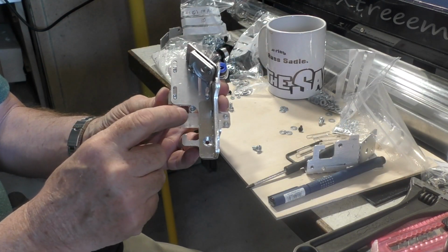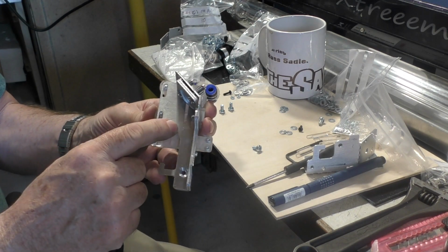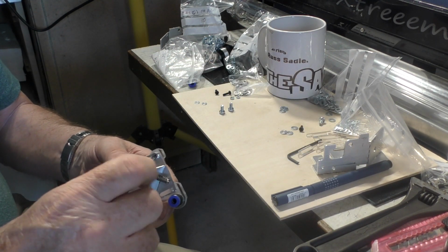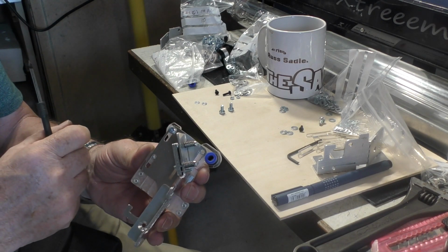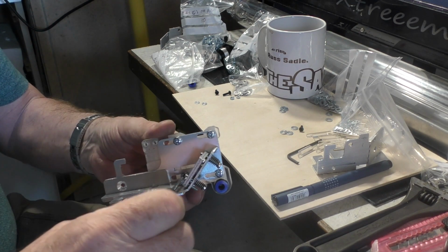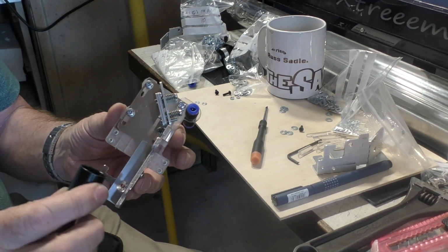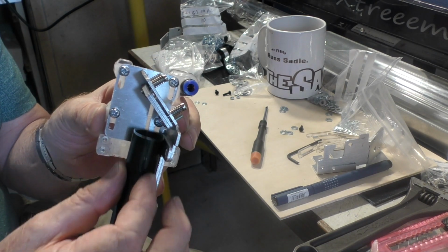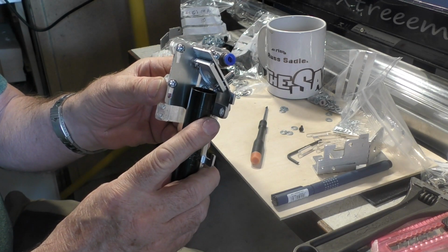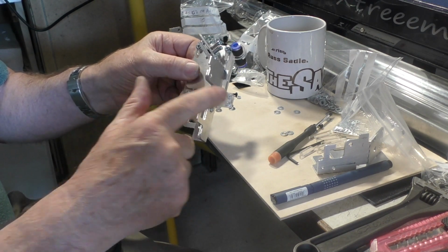You'll see that in doing that we've covered over 3 of the 4 fixing screws. If we drop the head down to the bottom of its slot like that, we'll cover up the 4th fixing screw as well. So we can then bolt the head on with an M4 8mm long posi panhead screw. The panhead is the most important part of that description because, and I'll show you in a second, this panhead screw here is the most important one, and why they're panheads. The low profile of the panhead allows this lens tube to slide past the head of the screw without hitting it. If it was to hit it, it would move the lens tube out of position. So we're now going to add the belt clamp system to these 2 positions just here.